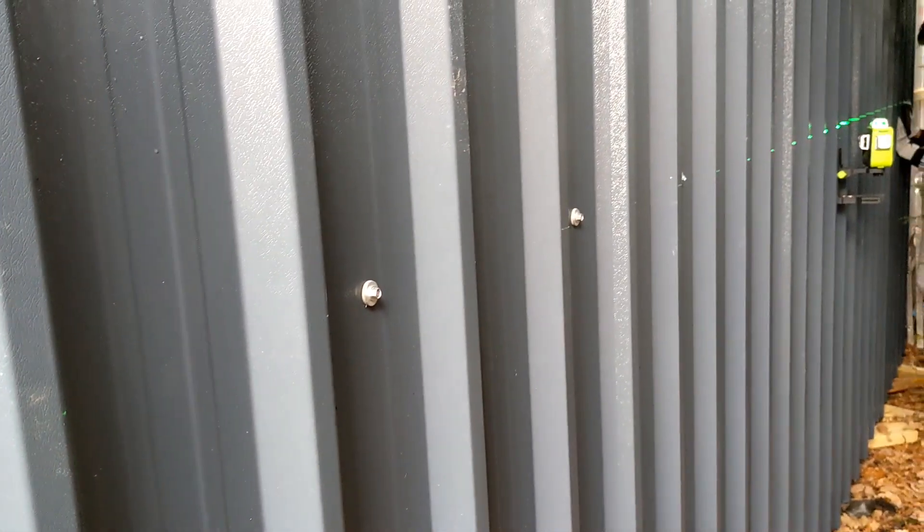So this is working out at 1,600 centres, which is working out well. Some of the screws I've overdone. So once I've put the top and bottom in, I will undo those, because I wanted to get it really tight and I've overdone them. They should be like this — where they've still got some crown there and that's not overly stressed. So once I put top and bottom in, I will redo it.